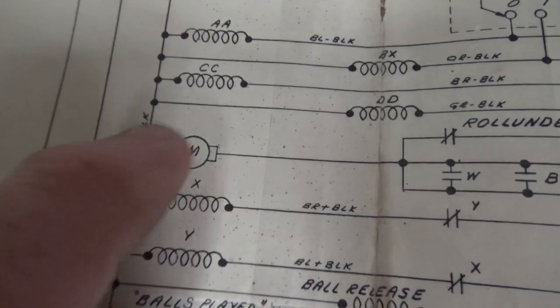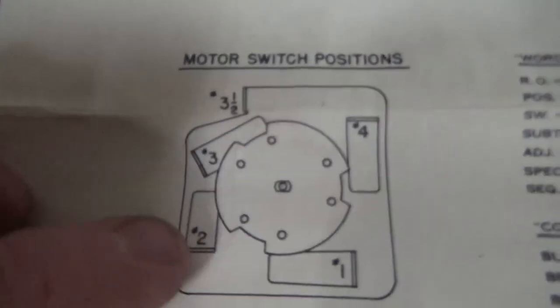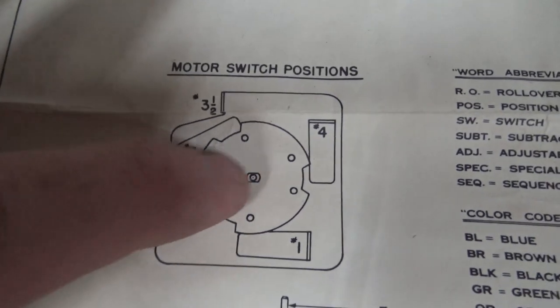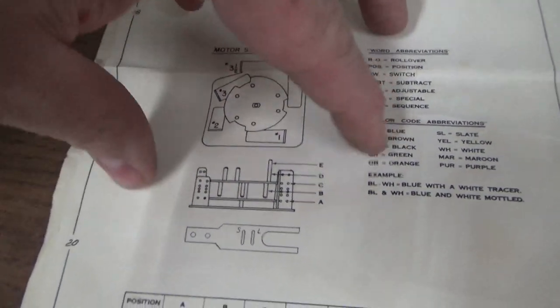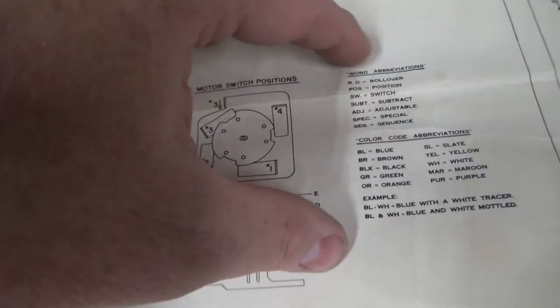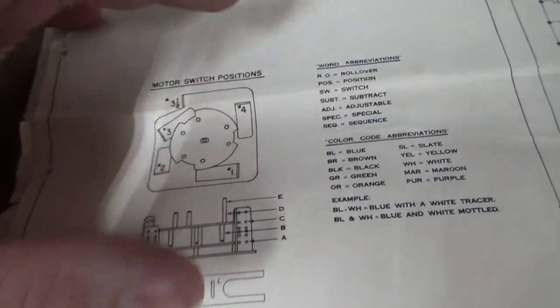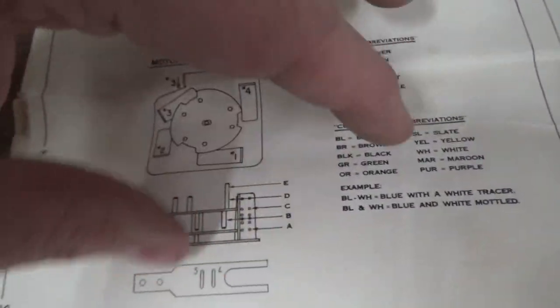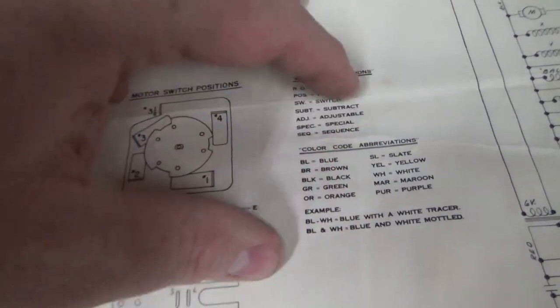The score motor turns one revolution from home position to home position every time it turns on, because this switch on itself holds itself on until it gets back to a home position. Okay, so if you look at the motor over here, see these three little divots? The motor is divided into thirds, the score motor, and when it turns, once it starts, so any of those relays, if they start that sucker turning, it immediately closes a switch on itself, and it will turn until it gets to its next home position, and then that switch opens and it will stop if the relay that turned it on or some other relay hasn't turned it back on. So it may turn a little bit, and then that turns another relay on, which allows it to move past its next home position. But as long as all of the relays turn off, it will stop at its next home position, okay? And there is actually a, I wonder if this one has the timing on it.